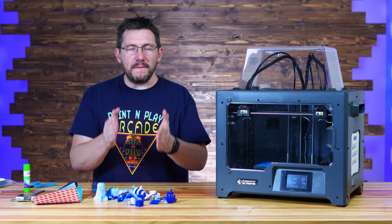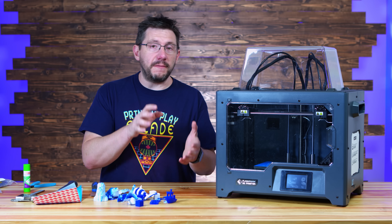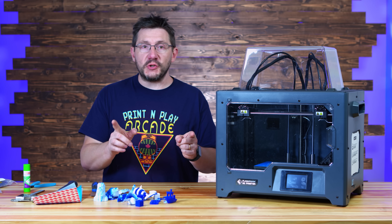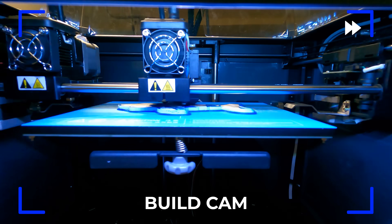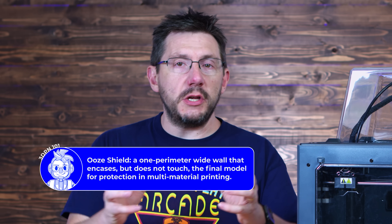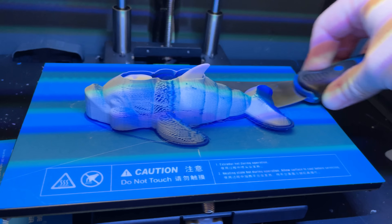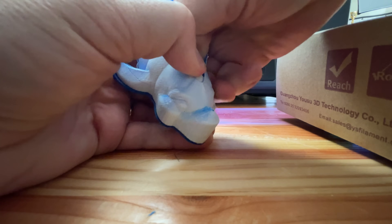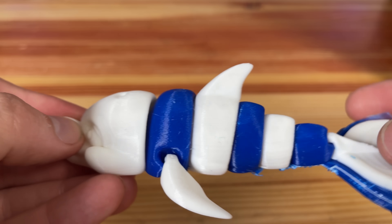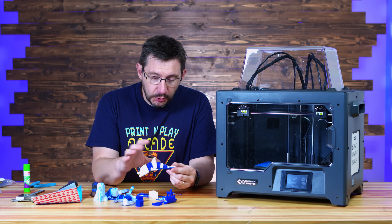Next, I printed the Flexi Factory Dolphin — an amazing little model. I split it into pieces and brought it into FlashPrint 5 to assign the left and right extruders to different pieces to make it multicolored. FlashPrint 5 defaulted to a raft, and for this dual-color print it also defaulted to an ooze shield around the print. The ooze shield was really difficult to remove and I only cut myself once. But the raft is essentially fused with the model, and even though the print quality is pretty decent, I cannot finish getting the raft off. The model looks really cool, but the raft is fused to it.